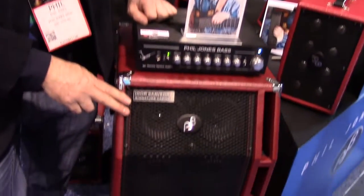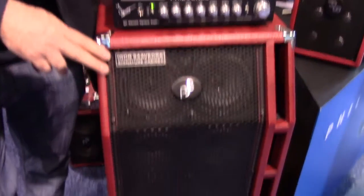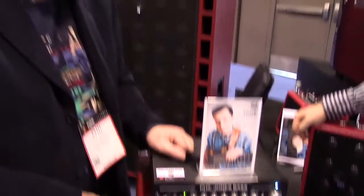This is a hybrid amplifier. It was specifically designed for Eagle's ARB amp and this special cabinet we developed for him. This cabinet has a frequency response down to 23 Hertz to cover the low F sharp of his instruments, and it goes up to 15 kilohertz, which is about as high as you ever need to go.